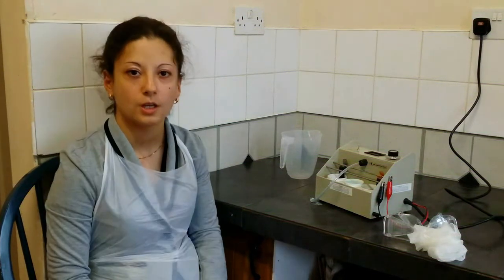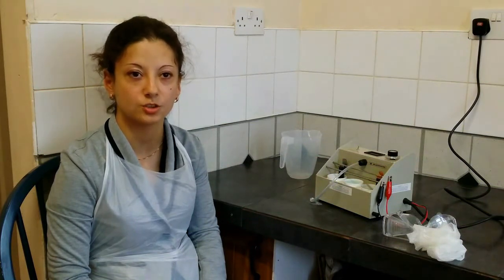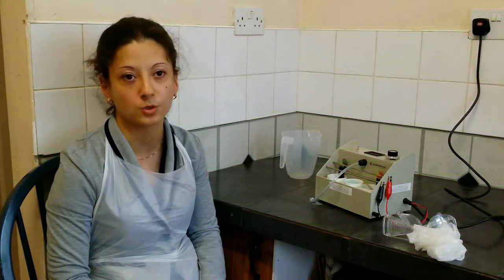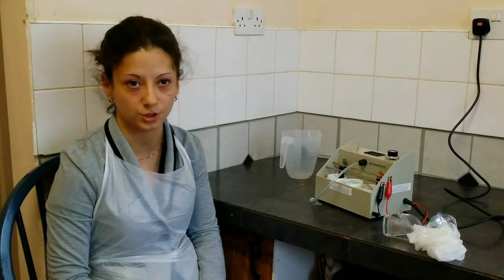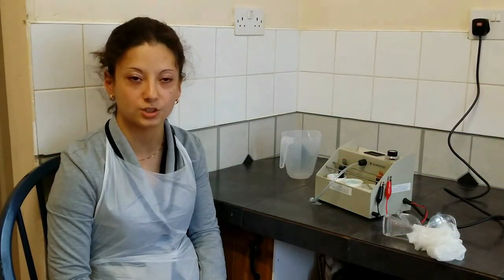Some metal types, such as stainless steel and aluminium, need to undergo additional chemical treatment before the electroplating process, otherwise they will just not get electroplated. During the electroplating process, it is very important to make sure that the object is not in contact with the anode, because this could lead to short circuits and problems with power supply. Hence, our anodes come with a plastic mesh to ensure that there is no contact between the anode and the object. Also, please ensure that the surface area of your anode is not smaller than the surface area of the object you are plating.